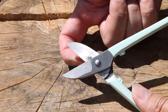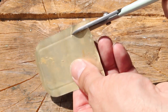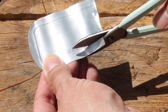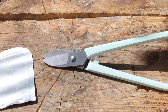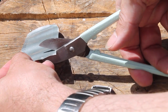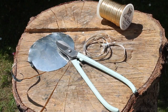This pair has rather small blades so it's designed for jewelry work, but when cutting a long thin strip it's important that you don't go all the way to the end of the blades. Doing so will create a little notch in the end of the cut, so only cut to about one centimeter from the end, then move and place the material back into the jaws. Repeat this action for a smooth and continuous cut. Because of the leverage, there's greater cutting power as you move closer to the pivot, so for tougher material make a series of short cuts and keep moving the metal closer in towards the pivot. You can also move your hands backwards towards the end of the handles to get maximum leverage.